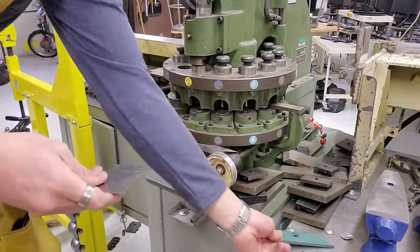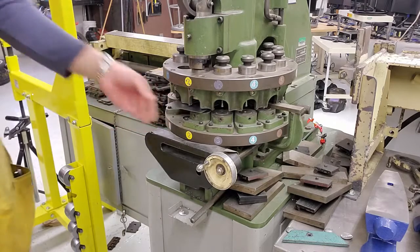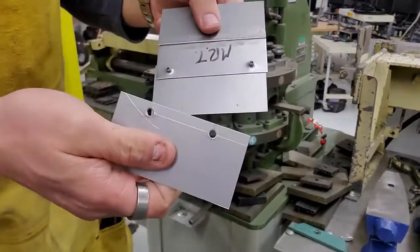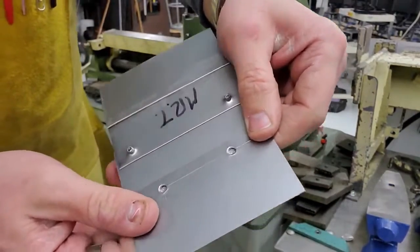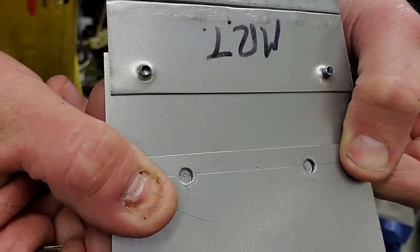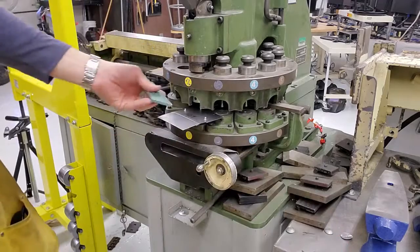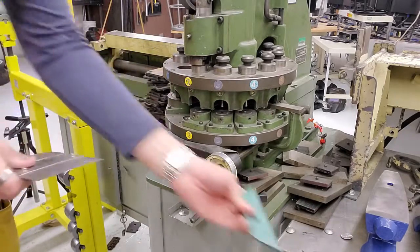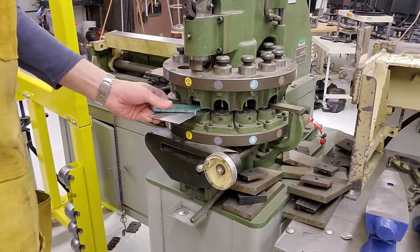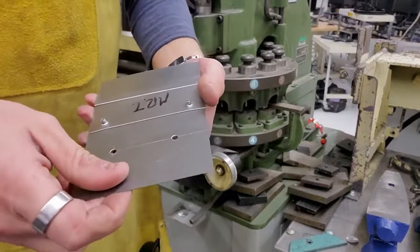I'm going to do that one more time on this side. Push that off. So if we've done it right we can double-check right now — if I take this piece and set it over top, we should be able to see our other dents from the center punch centered in both of those holes. That's looking pretty good. We're going to do that on this side as well. Handle's all the way back; we are ready to go install those rivets.